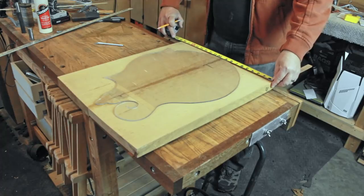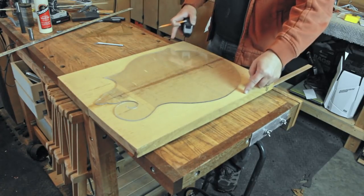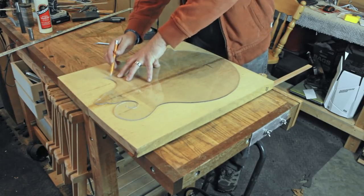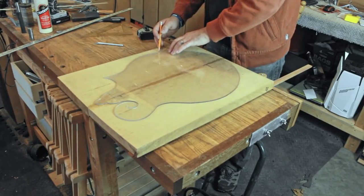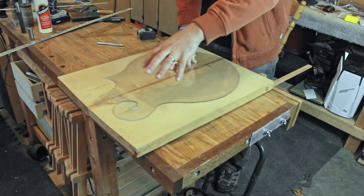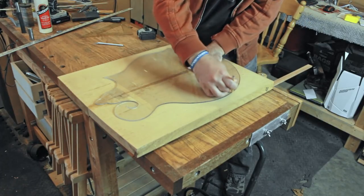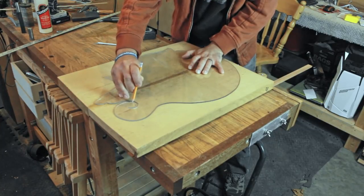The sander can get 17 inches, and here I've got 18 and a half, so I'm going to have to trim a bit on both sides on the table saw. So what I'll do is highlight where the location is going to be. As you can see, I lined up my center line. I also made sure that the top side would be oriented properly, so it's not flipped the other way. So this is the top side here, that way I'll be able to know how much I can remove on both sides to accommodate for my 17 inches.